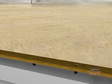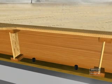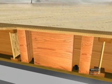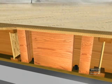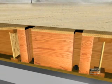First, install the mud sill over the SSW AB anchor bolts. Install rim joist and solid blocking the full width of the strong wall above. Allow space for the threaded rod to go down through the subfloor. Next, drill a 2-inch hole or a 2-inch by 2-inch notch in the subfloor to allow for compression nuts.